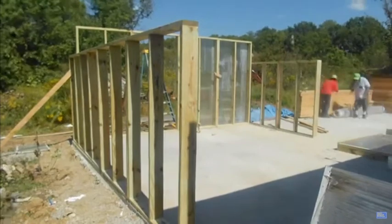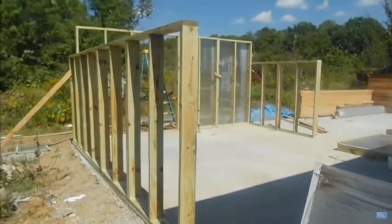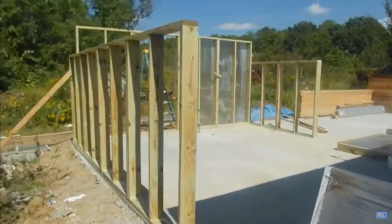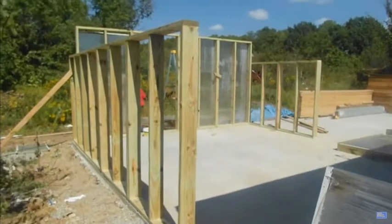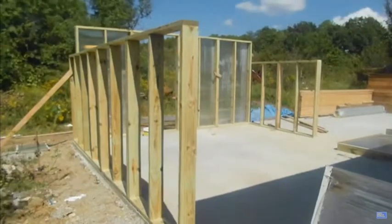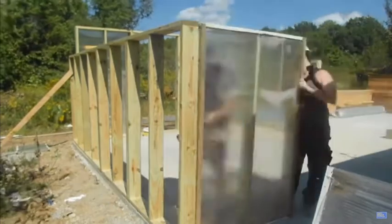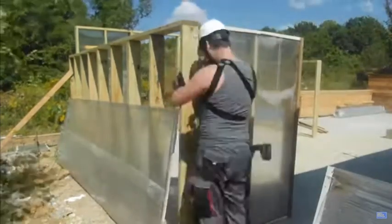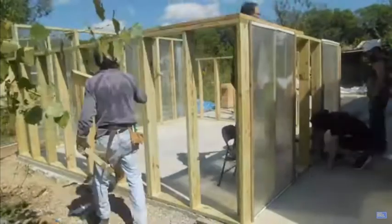Definitely not just two screws — I saw people leave the corners at two screws. You want to button that up quite firmly. We're using one stud into another. In the Seed Eco Home we have that nailing plate concept where we pay more attention to the corners for higher wind speeds.